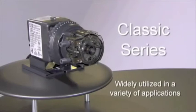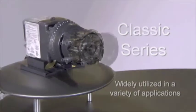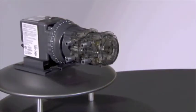The Classic Series is the most widely used pump, and it is the one that Stenner has been manufacturing the longest. You could say it's time-tested, especially with one of the most popular disinfectants and oxidizers, liquid chlorine. The pumps can be used with a dry contact water meter for proportional dosing, wired to a well pump pressure switch, or installed with a controller. The Classic Series is available as a single head or double head, with either an adjustable output or fixed output.